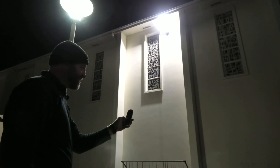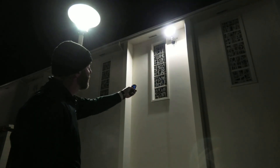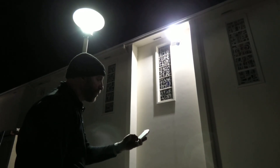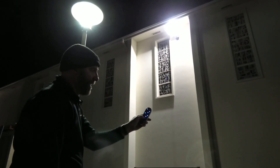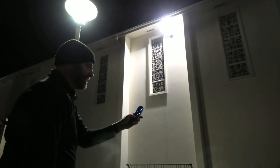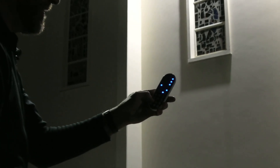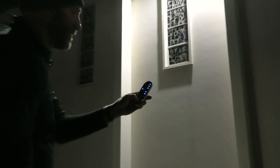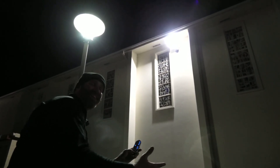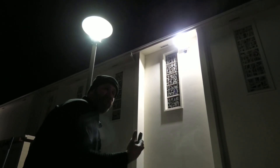Quick pro tips on these motion sensors — there are some blue LEDs in here so you can see where you're at when you're testing at night. A quick press on the send button and you can see that little red light in the motion sensor go off and the light adjusts. Press on and off to toggle the LEDs. You can pop through the different brightness levels at motion, how long it stays bright, the dim setting from 10 to 50%, how long it stays there from infinity to 1 to 10 minutes. There's a sensitivity setting to adjust to your needs, and a daylight sensor you can set to different lux — so the light comes on at different darkness levels. You can also turn that on or off, so if you want photocell dusk-to-dawn service you can use it; if not, you don't have to.